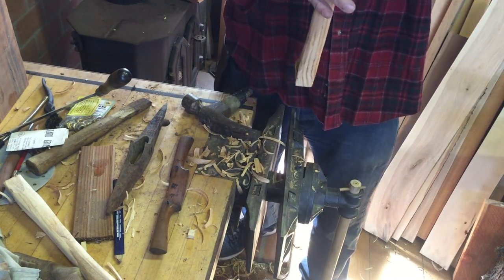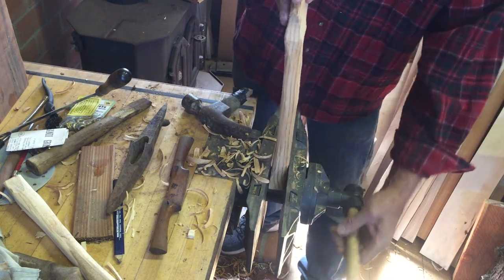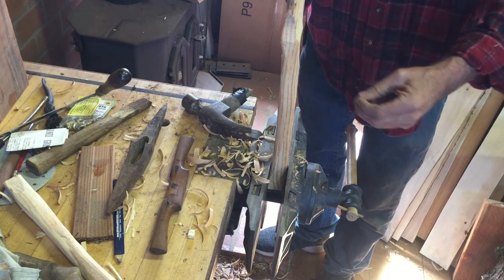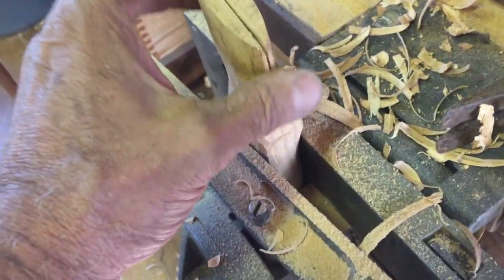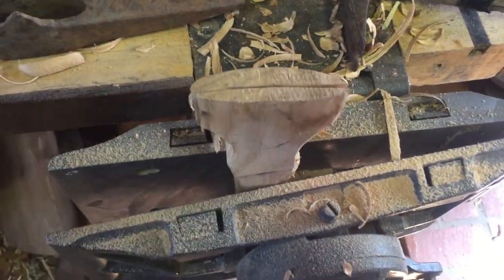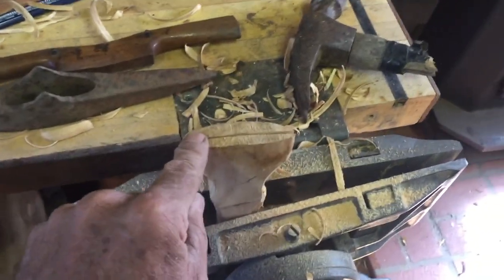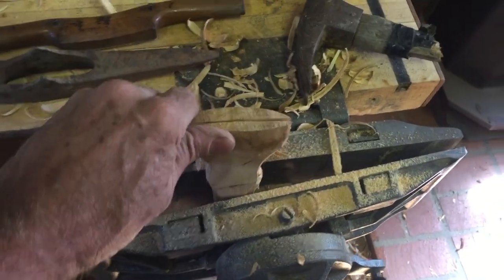I'll do some of the detail work a little bit later. The next step is to fit the handle — I want to rip a slot through the middle. If I use the band saw I think it'll be a little bit too wide and might make it gappy, so I used a thin curved saw and went all the way down to where the edge of the handle is, because I want this to expand when I put a wedge in there. At this point I'll continue to finish off the handle — but not a hundred percent — because at the very end I'll be pounding it on and that'll probably scratch the handle up. Then I'll do a final finish sanding at the very end.